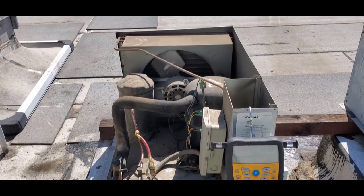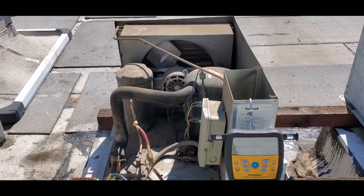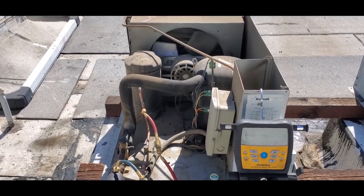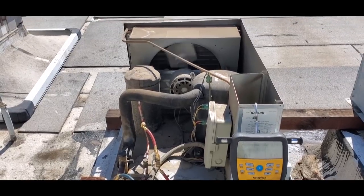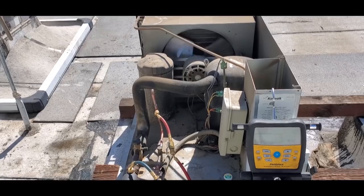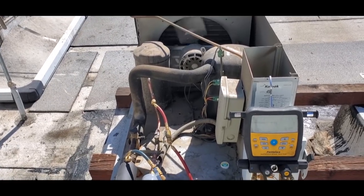Go down and check to make sure that the thermostat's accurate. That's the last thing I'll do. We can't really check evaporator superheat because I'm not going to wait for it to come down to temp. We'll check it the next time we come out. But usually these valves come preset for about 8 degrees superheat when it's a low temp valve. So we should be good.